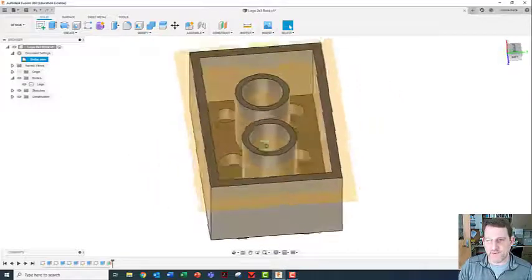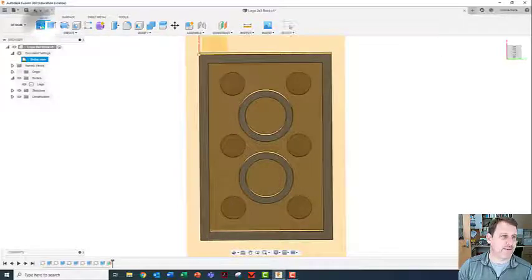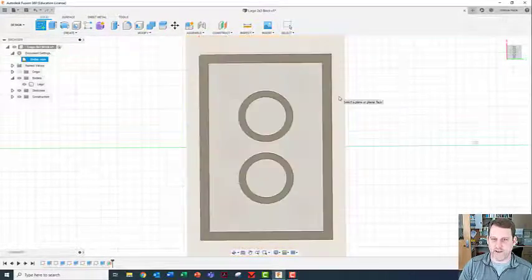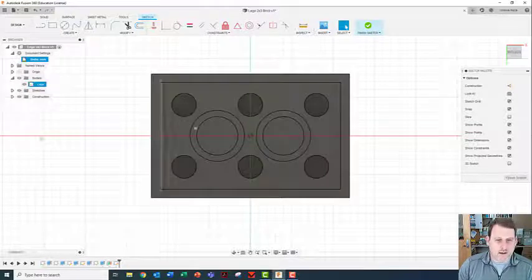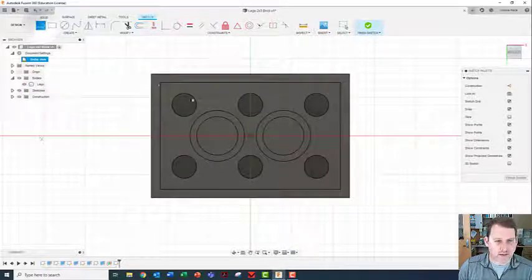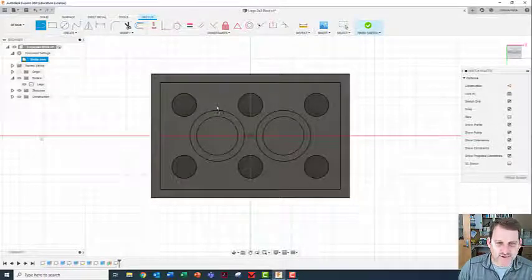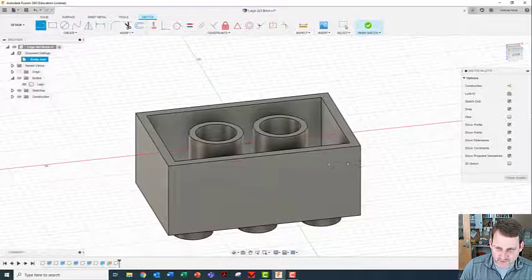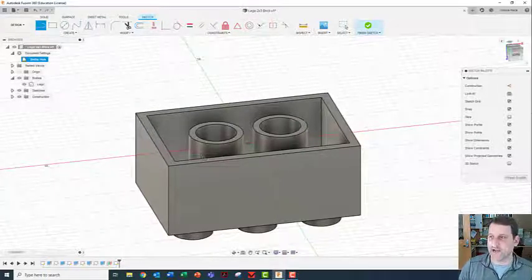And now I'm going to come back here, and I'm going to redraw those webs. But this time I'm going to position them really carefully. So I'm going to do a sketch, and then I'm going to sketch that plane that I just created. So notice there's that yellow plane. Now it's gray. I want that one. I can't actually grab the center when I go here, because these circles don't exist on my center, right? So you can see where my plane comes through. See where the graph paper goes through the wall? This circle isn't on that plane, so I need to project it first.